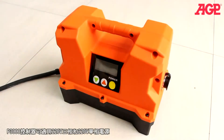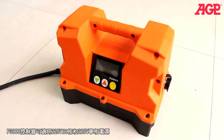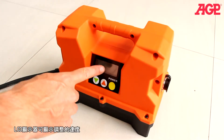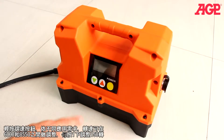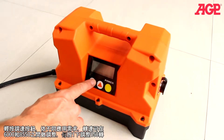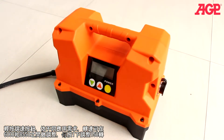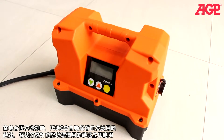The power converter is designed to operate on both 220 volt 3-phase and 220 volt single-phase supply. It has an LCD display screen showing the speed setting, and adjusts from 6000 to 8550 RPM by pressing the buttons up or down in increments of 150. It remembers the speed setting from the last time it was turned on.